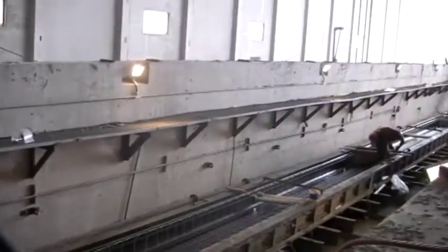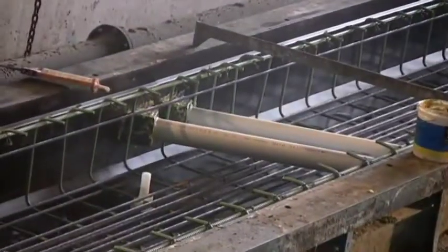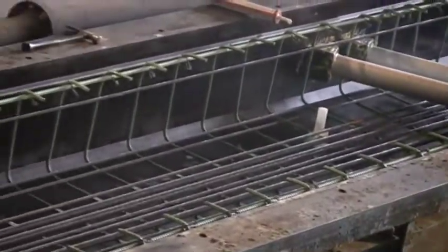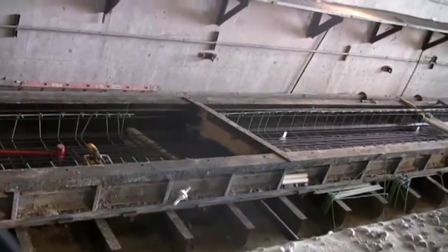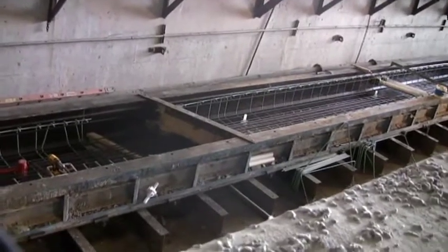Those things that are going across the pieces, this is what they call a box beam on a bridge. They will actually take threaded rod that goes through the pieces and tie the piece that's on that side and this side and this side. They'll bolt them all together and squeeze the bridge together this way. They do this on small county bridges. You won't see that on the big ones on the interstate.